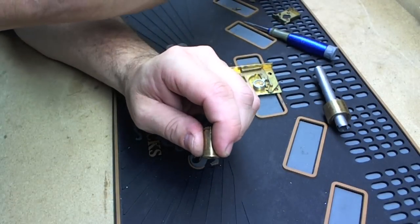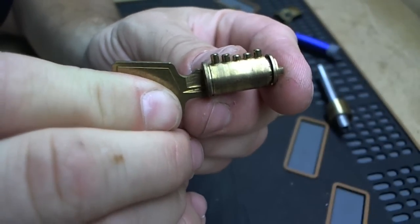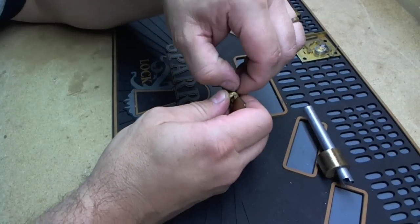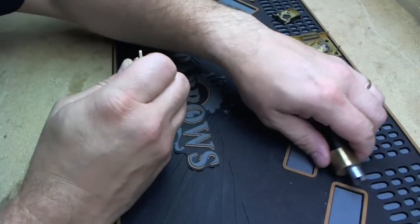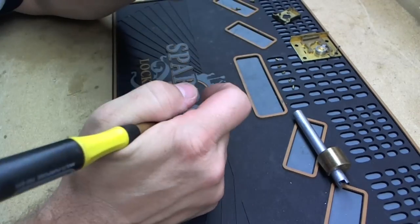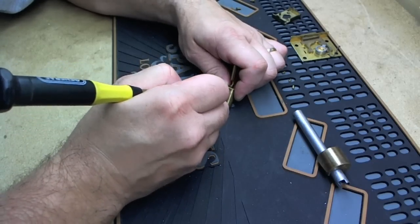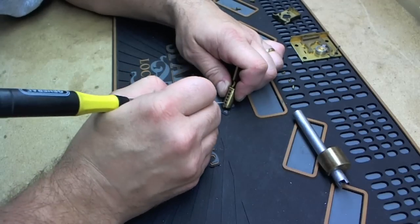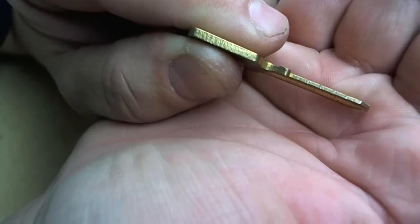If you drop them all over the place it doesn't really matter unless you've got a bunch of these that are keyed alike. I already had a key blank picked out for it. So now here's what we have. I normally use a code machine, but I'm going to do it a little different here. I'm going to take the pins out and put them in my Sparrows pinning mat — one, two, three, four, five. This way you guys can see how you can do it at home using a generic file set. With the key blank inserted all the way, I'm going to use my file and go into each one of these pin chambers and just kind of scratch the key blank. And there I have my spacing — all five marks. So that part's done.